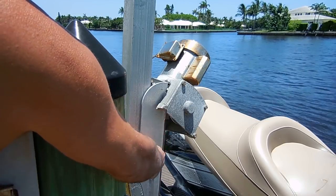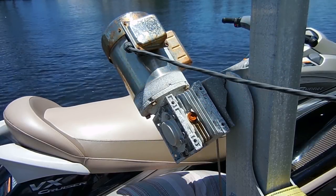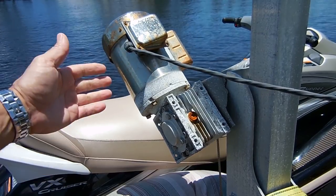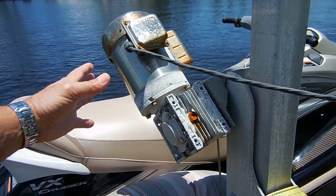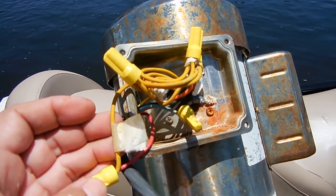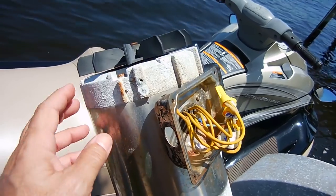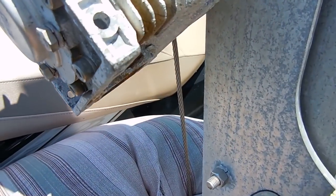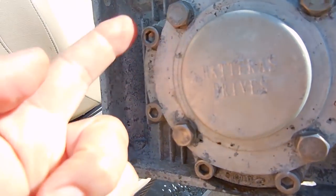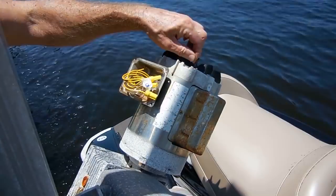The first thing I'm doing is turning off power to the boat lift and disconnecting the cable going to the motor. I also placed a cushion on the jet ski rail just in case it's too heavy when I release tension from the cable. I'm going to label everything so it goes back exactly the way it was when I reinstall the motor. I'm also going to replace this connector. I decided to remove the end that covers the fan and gently rotate it in the right direction until all the tension has been removed from the cable — it's nothing more than a worm gear, with a shaft coming down turning a larger one.